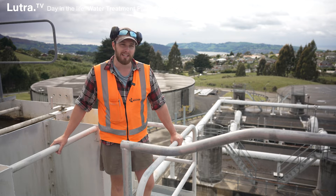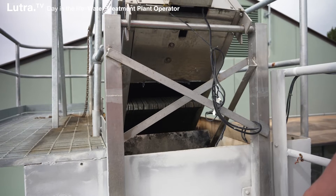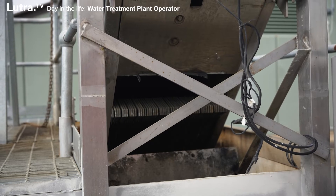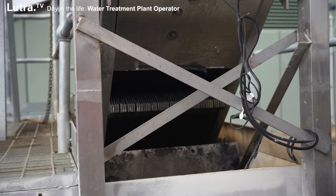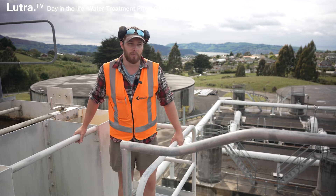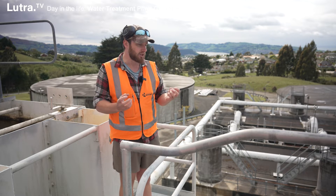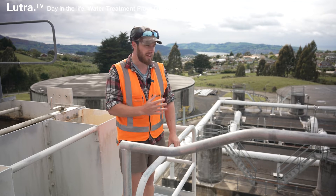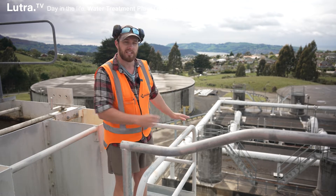So we're running a DAF plant here. What we're standing on now is the parallel plate separator — this is our water's initial screening point before going through the plant. After here it moves over into the building off to my left, where most of the turbidity and dissolved organics get taken out of the water before moving down to our sand filters.